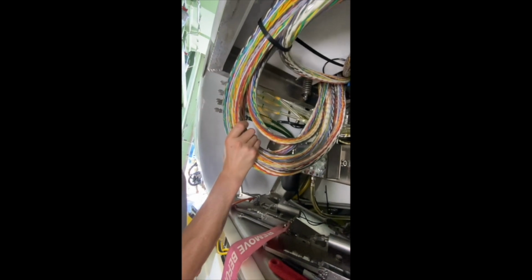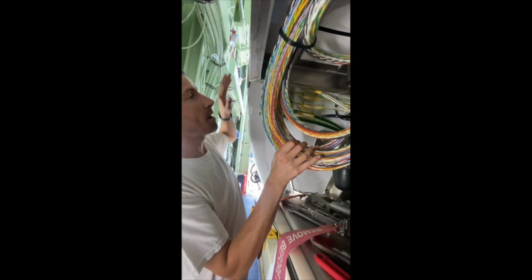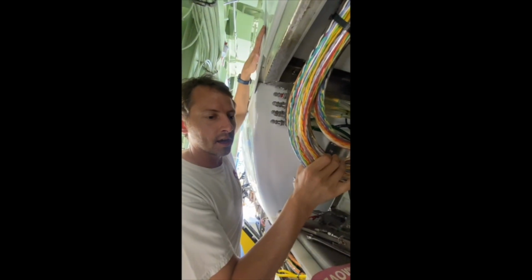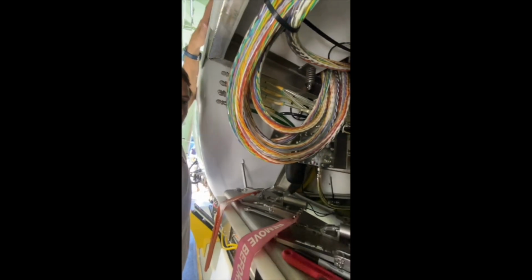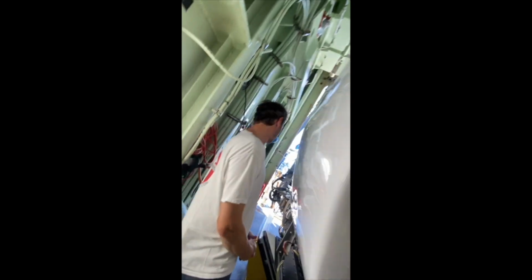You can see many of these cables here, they actually have oil in them. Now that's not a change from the 4,500 meter sub, but what they connect to is they run up underneath this ballast tank to the sphere, and those are the penetrators, which is where cable and fiber optic penetrators move in and out of the hull, the main pressure hull. So those penetrator designs had to be changed for 6,500 meters as well. Side viewport there.